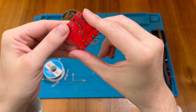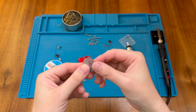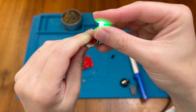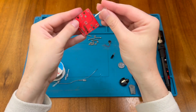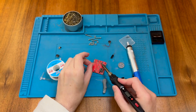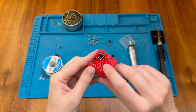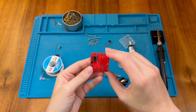So now we can do those LEDs. We can check the polarity with a CR2032 battery — the longer lead is usually positive, and we do indeed have green LEDs. Let's stick these LEDs in. It's important that we did this LED first because the battery holder needs to be soldered on top of that position.